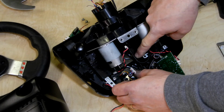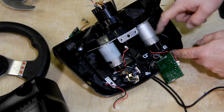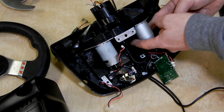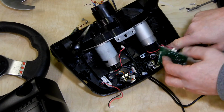Alright. And then the wire that we added will loop around here. It goes underneath the motor. I was going to try to put some extra in here, and I did not, because we don't want the extra wire getting caught up in the gears or anything like that. So keep the wire tight enough that it won't get up in the gears. And I bring it back.